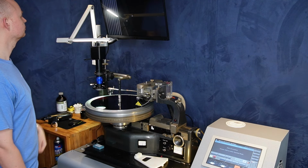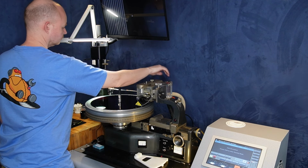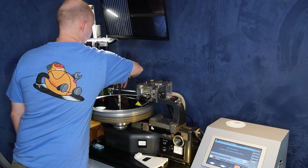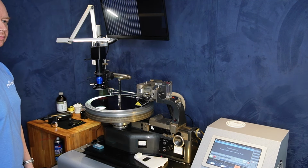Everything's looking good. There's some movement in the groove which comes from imperfections in the lacquer blank, but this is acceptable. Each revolution is nicely separated, so there's roughly a 10:1 ratio of groove to land. Land is that space between each groove. Without that, you have no safety margin, and you might be able to hear an echo from the previous groove.